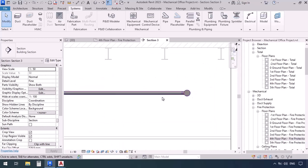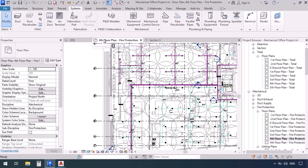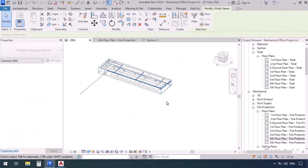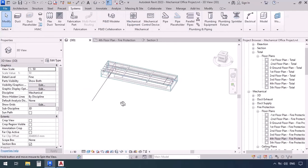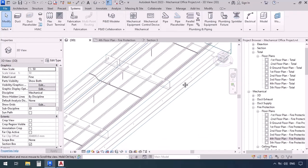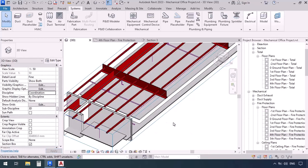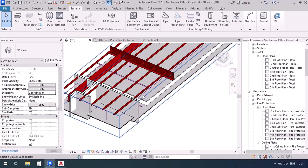We've drawn this pipe at a lower elevation. Let me go back to the plan so we can see this entire part in 3D. I'm going to select and press BX. So we drew this pipe at a lower elevation so that it goes past this beam and this one — from here on out, it can go higher. Let me set the discipline back on coordination so we can have a better view.